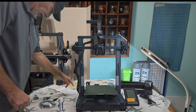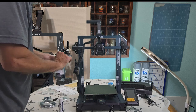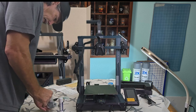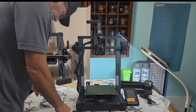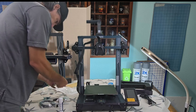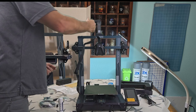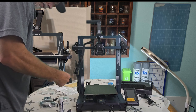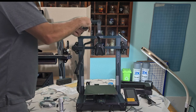we're going to put this filament sensor on. It will shut the machine down when your roll of filament runs out. And the bolt for it is already in there in the bag right here. I believe it's going to be this same Allen wrench. No, this one here. Yes. And since our roll is going to be on this side, because there's a plug right here for this, we're going to put this in on this side. Just like so.